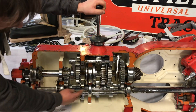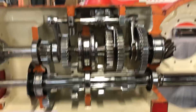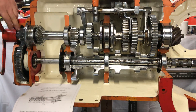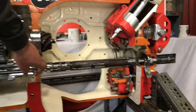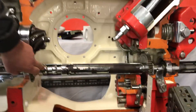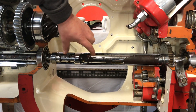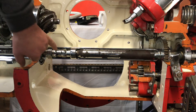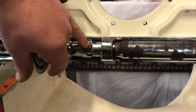What's happening is we've got the gears cut away, and we've also got the PTO here operating. The PTO comes down here through this transmission shaft, through the lay shaft. The PTO is engaged at this far end. There's a sliding mechanism here that can sometimes fail when people fail to engage the hand clutch correctly — it knocks the edge off this spline here and we get a ratcheting noise.